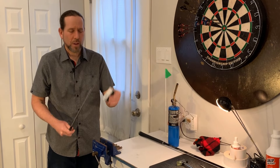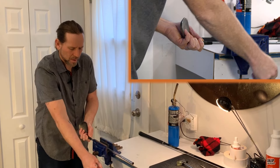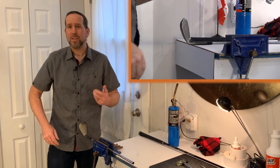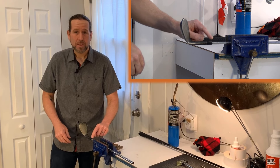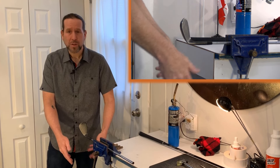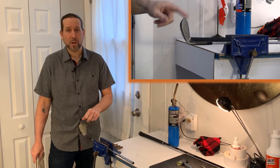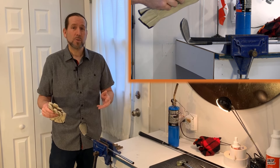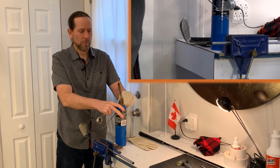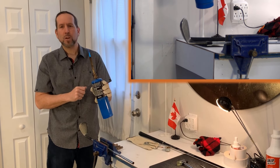I'm going to use my trusty golf club vice clamp here and tighten it up in my vice, give myself a little room to be able to heat it up. This ferrule here — this plastic aesthetic aerodynamic piece — is likely going to melt and kind of fall on the floor, so give yourself something on the floor to catch those drippings. You're also going to be handling a hot golf head, so good to have a set of gloves. Welding gloves work well. I'm going to fire up this torch.